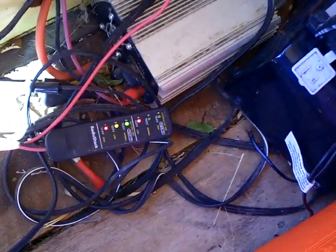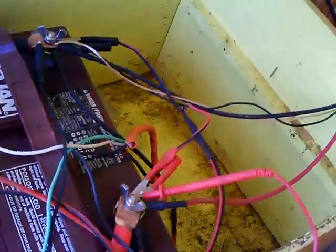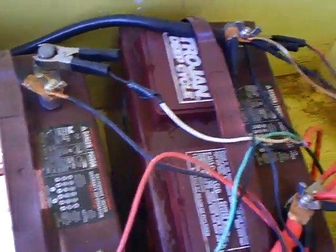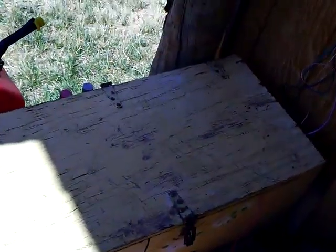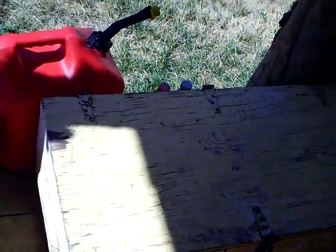A good monitor in addition to your inverter, power controller, batteries, and panels is all you really need to operate all the electrical systems in your house. That basic solar electric system provides enough power for everything I have inside, including a water pump, TVs, laptop computer, lights, and all the gadgets inside the house. I'll explain those when we get inside.